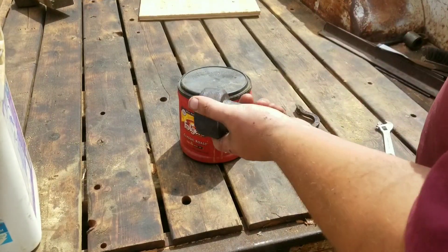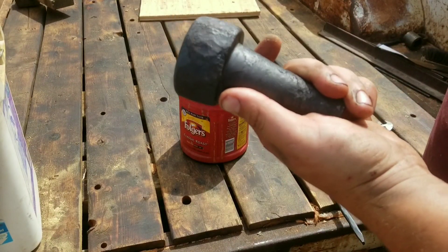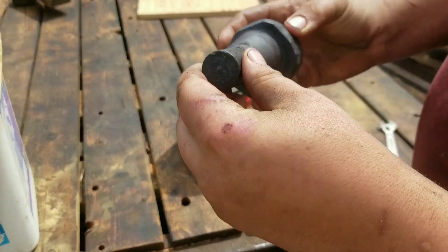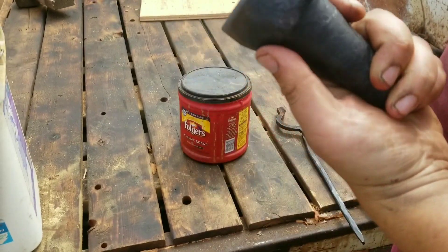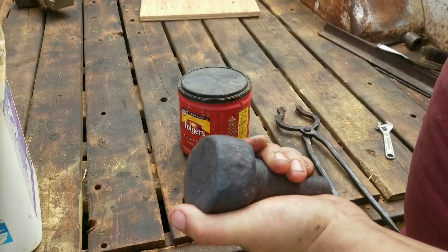We've moved to the front of the shop, to the back of my '64 F100. This here's the forging — I let it cool down. It is a little bit lopsided, not perfect, but because this is going to be a boring head holder, I'm not super worried about that. So the next step is not actually to machine it, but to pickle it.